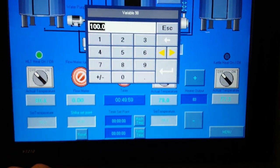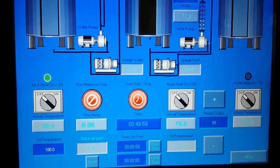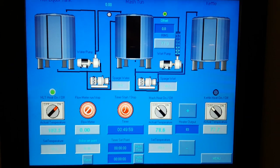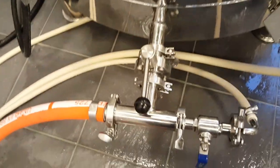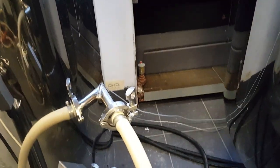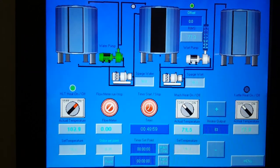So what we'll do is set the temperature that we want. It's already set to 100, so that's what we're going to do just for this test — just hit the button, hit it harder. So now the temperature's come up, and our next order of business is to turn on this water pump here. What that'll do is draw the hot water off the bottom and recirculate it back into the hot liquor tank. It'll take the water through this orange hose here, which runs over to this pump, and that gets pumped to this tangential inlet, which is going to create a whirlpool inside. That will help keep the temperatures even and prevent any cold spots or hot spots.